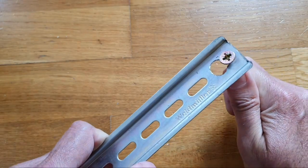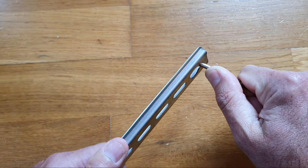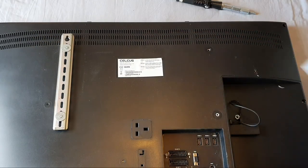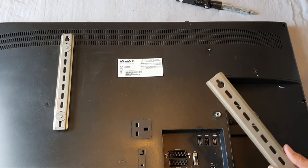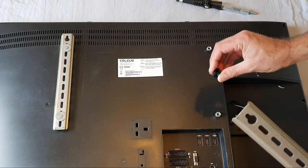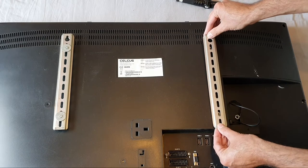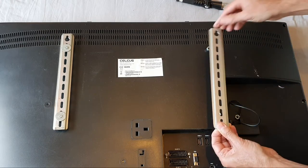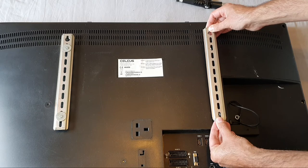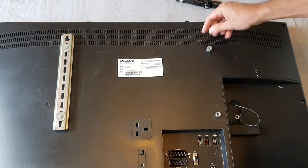It's a novel use — instead of circuit breakers you can hang your TV off of it, and it allows the TV to hang very close to the wall. You take your piece of DIN rail and space it up ever so slightly. I use nuts or plastic bushes to space it just enough so the DIN rail is away from the TV to stop it bending in as you tighten the screws. If you want the TV to angle forward slightly for better viewing when it's mounted high up, you can space one side up more than the other by stacking a few nuts.